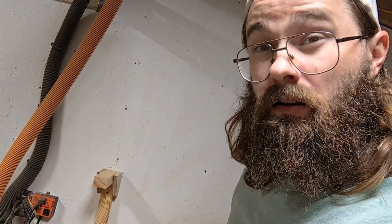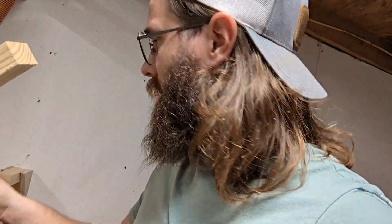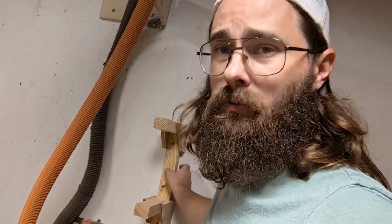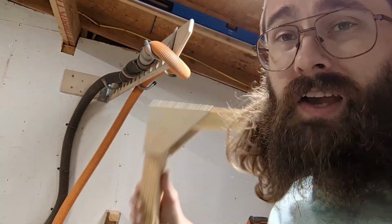So what I like about these is once you have that bottom rack set, all you gotta do is take your next one, square it up on top, and run it up. That's all you gotta do. All your cuts are square, so square it, plumb it, square it, put it in a stud, and stack them on top as high as you want to go.